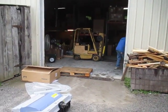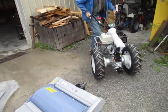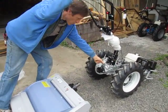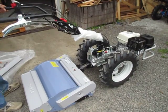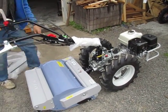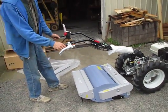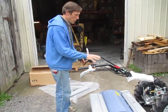I'm going to grab a tractor here — this is a Grillo G107 — to demonstrate getting this on the tractor. I'm going to turn my handlebars around. It's always best to mount implements with the handlebars in the rear PTO position, as we cover on our quick coupling video. Raise this quick coupling knob. As you can see, the angle of that is just totally wrong, but since I'm on this end of the machine I can just reach down here and bring this up and align it, bringing it in with a slight up and down wiggle — that's the patented quick hitch jiggle. Drop it down into the hole. And you can see that rotation I talked about at the beginning of the video — that's the floating effect that lets the flail mower follow the contour of the ground. Of course, you don't want to mow like this — you would turn the handlebars back around and mow in the opposite direction. But this is how you want to mount or dismount the flail mower.